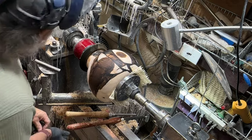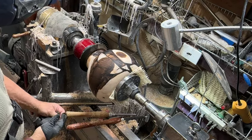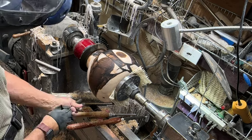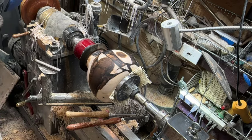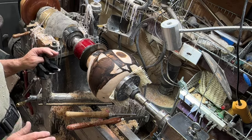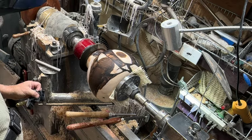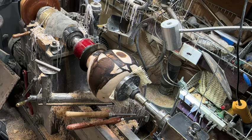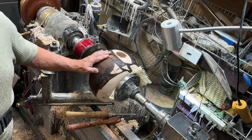I've got the vacuum pump up. It's 27 inches. I think in this area, with the altitude above sea level here being not at sea level, I think the most vacuum you can get is 28 inches, and I think perfect vacuum is 30, and I don't think you can really get 30 inches. At sea level you'll get close, but a perfect vacuum isn't really achieved very well on Earth here.